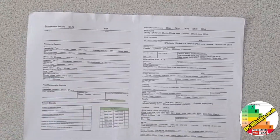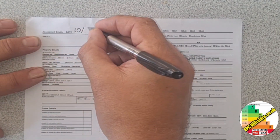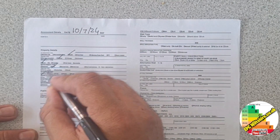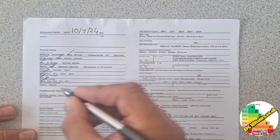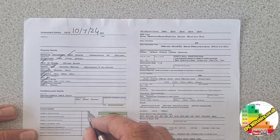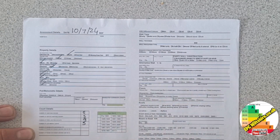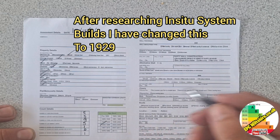Let's get the site notes written out. Today's date is the 10th of July. Get the date wrong on your notes and that's an instant audit failure, so watch out for that. So it's a rental, social house, semi-detached, with no extension because that rear lean-to is not thermally connected to the house in any way. It has a gas meter and a single-rate electric meter. We'll measure it internally. We have three bedrooms, a lounge, and a kitchen that can hold a table with four or more chairs — so that means it has five heated habitable rooms. The number of lighting outlets was nine, and five of which were low energy bulbs. We have a bath with a mixer shower, so that is 101. And the build date was the 50s to 1966.